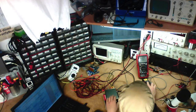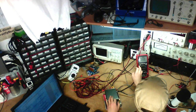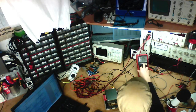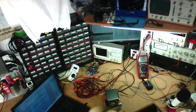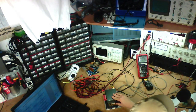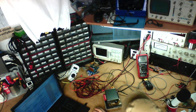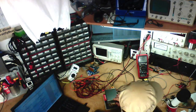Let's do the same thing for the right channel. 8 volts, just about 8 volts, 7.98. Managed to strike the same exact spot. Differential measurement, load off, 0.514. So that's obviously going to give us the exact same result, since we are entering the exact same number. So 0.275 ohms output impedance into 4 ohms on the right channel as well, measured at half output power.